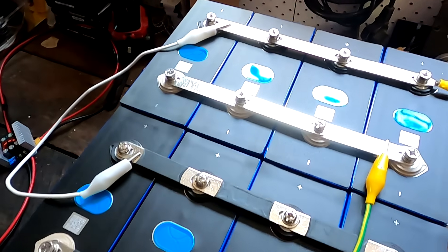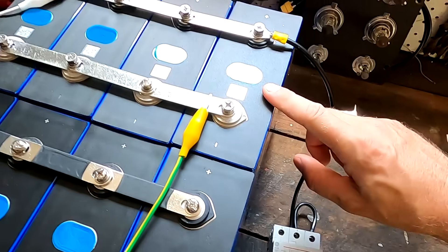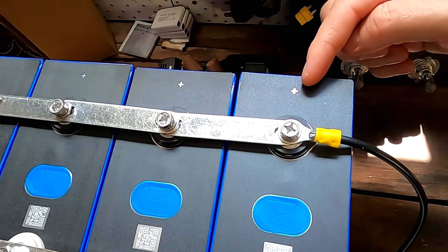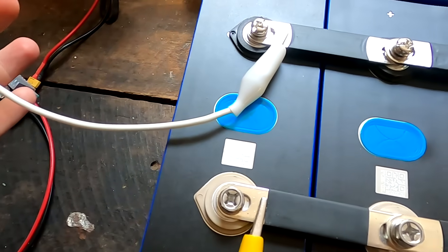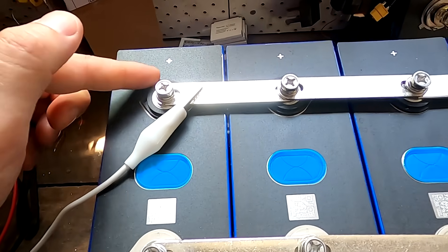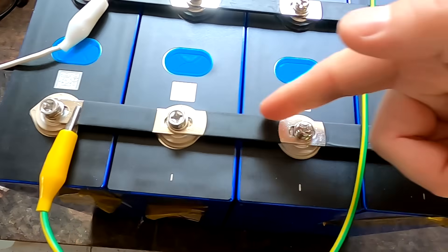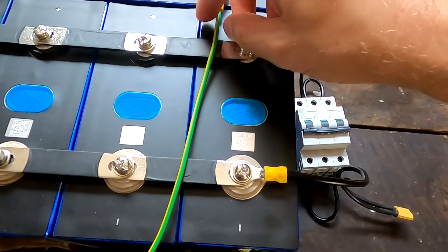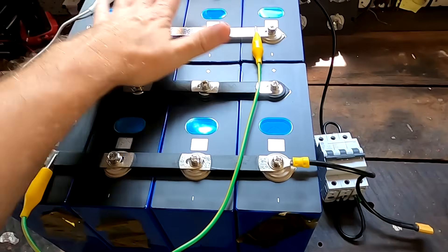At the moment I've got all the batteries in parallel to balance them, because there were two different deliveries — one came by airplane and one by container ship, the Hyundai Vancouver. I've got all the positive terminals connected for each battery bank, with a white lead connecting the positive bus bars together, and then the same for the negatives with a green-yellow connection between the negative bus bars.